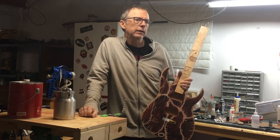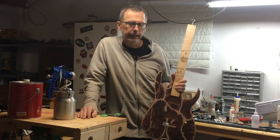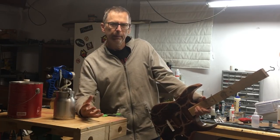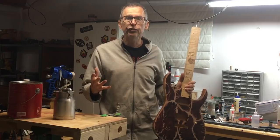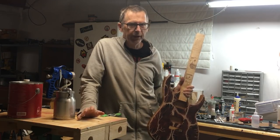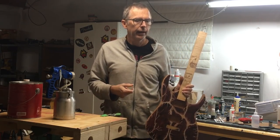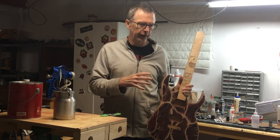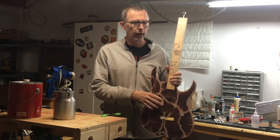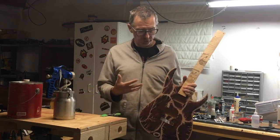When it comes to water-based clear coats, people either love them or hate them — there's really no in-between. I find that the people who love water-based clear coats are the people who have actually figured out how to apply them with the least issues and problems. The people who hate them are trying to apply the water-based the way they would a product they're more familiar with, like nitrocellulose lacquer. You really can't put water-based clear coat finishes down the same way as nitrocellulose — you can have issues.